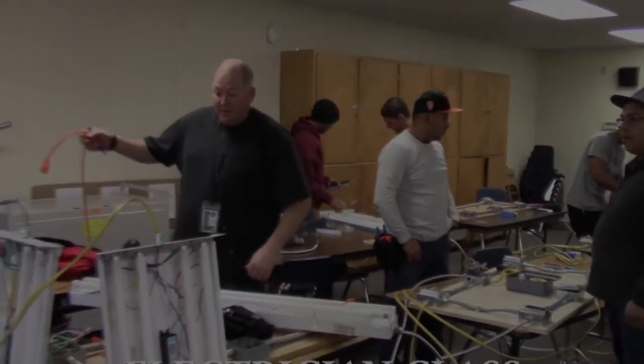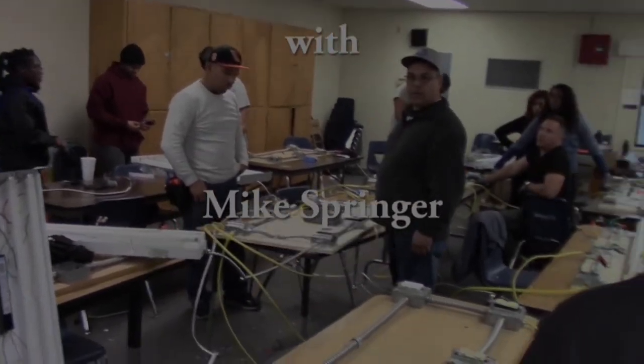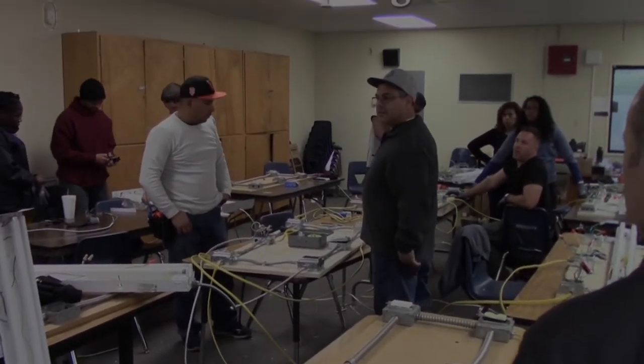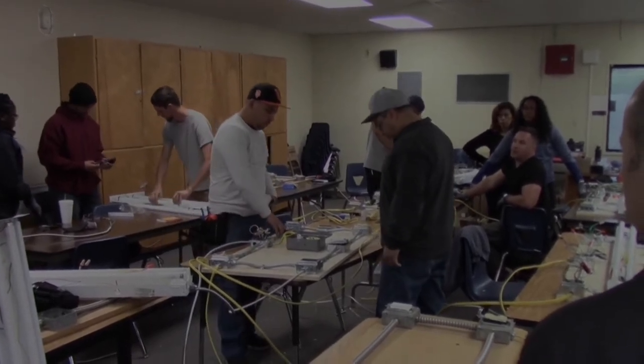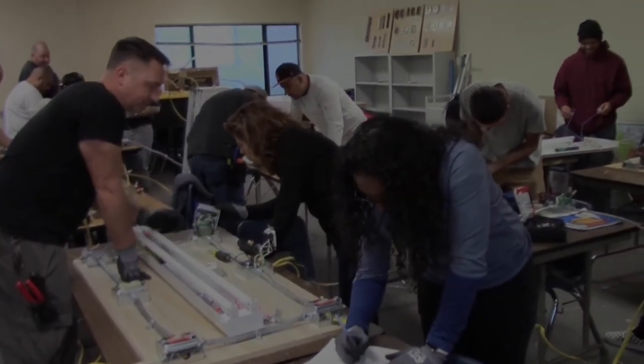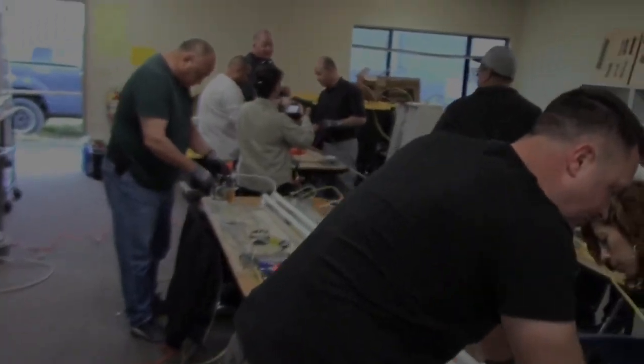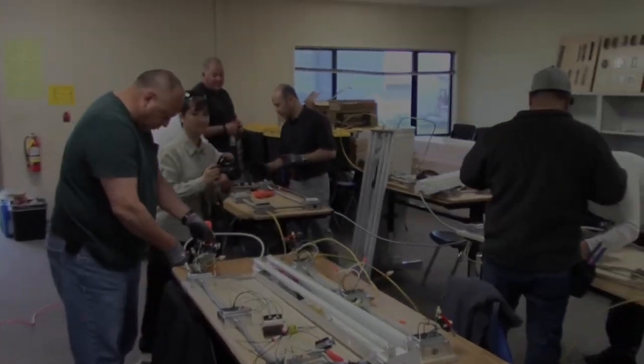You can have as much as you need on there. Power's off? Yep. You just have to be on the right side — the line side. Other than that, you can tie in as many as you want on the line side. We're going to get power from your switch and then everybody else should be getting power from here.